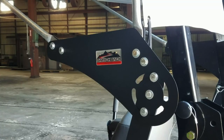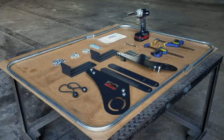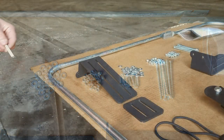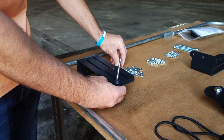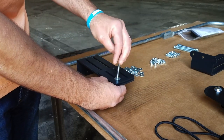Today we will be installing the Perry Company Switchback Retractable Canopy on a Gravely ZT-HD Zero Turn Mower. First, we will be installing the bracket plates around the ROPS. To aid in this process, place a washer on one of the 4-inch bolts and insert it through both bracket plates. Once through, place another washer on the end of the bolt and secure it with a 1/4-inch nut.